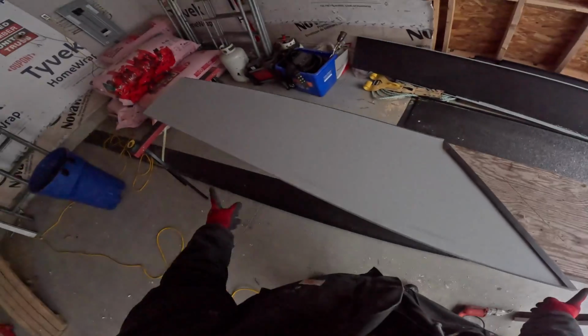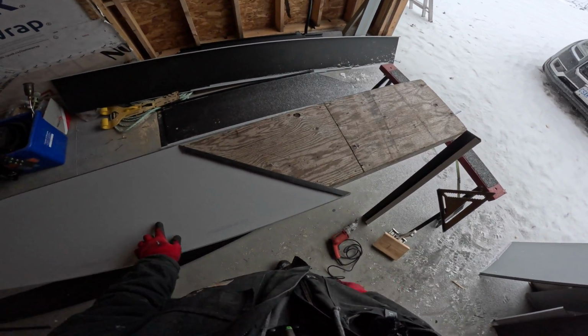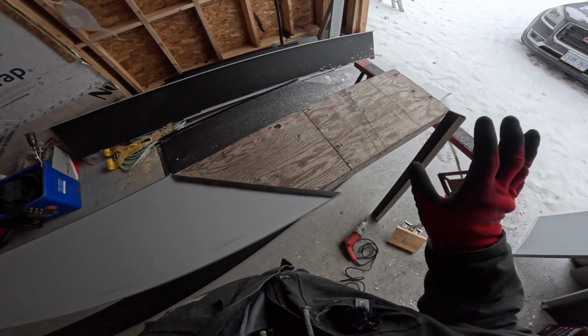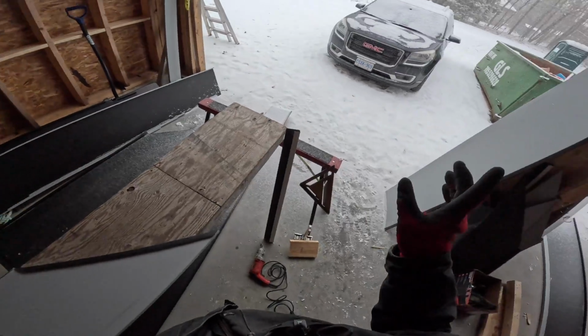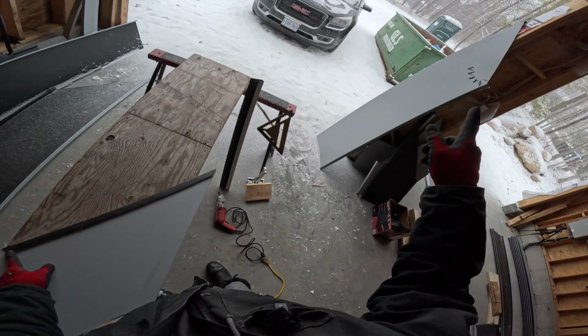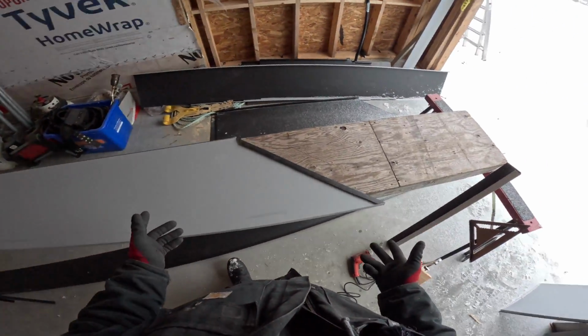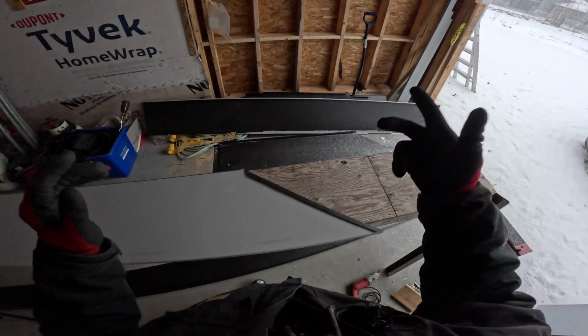I have this length on the board. Last one's crossed out. So when I come back down next, I don't have to measure anything up there. I just know the next female seam is going to be 96 3/4, and I add the step to that. So if I had a crew up there, I'd pass this up and get started on the next panel.